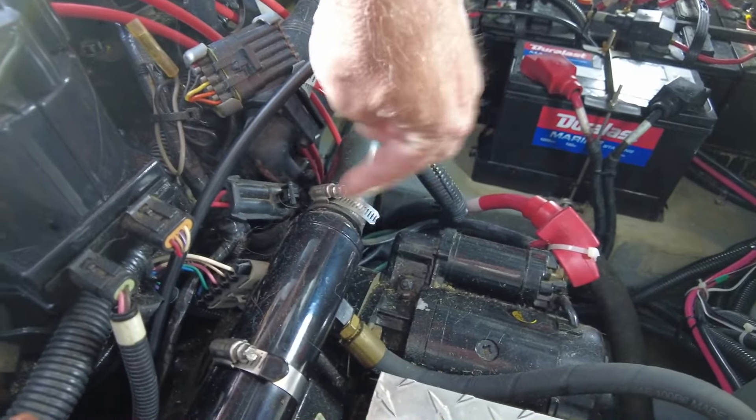Something I want to point out — if you have through-hull transducers, you should have these: emergency bungs. They're just plugs. So if a transducer popped out, broke, hit bottom, whatever, and there's water gushing through, these are designed to be shoved into the hole to plug the water. If you don't have them, you can buy them in wood or rubber — just look online. A good thing to have just in case of emergency.